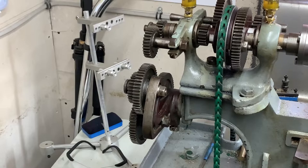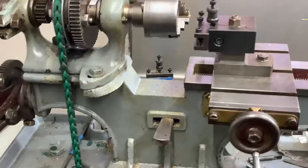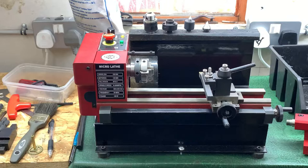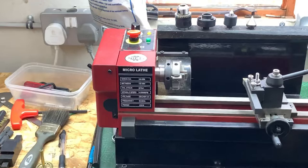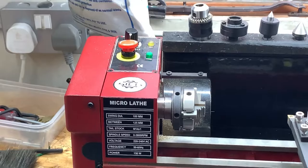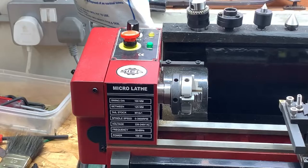It's got a set of gears on the back to slow it down, and it's got a gearbox. Now, coming over to the other bench — I bought myself a small Chinese micro lathe made by Sealy. Nothing particularly special, but the handy thing about it, as you can see, is this scroll chuck. So when we're polishing pivots and doing various things it's a lot quicker and accurate enough for what we want, and it has a bit more power.